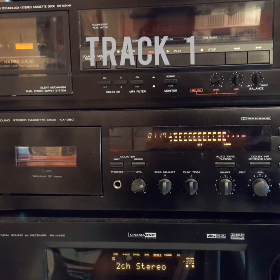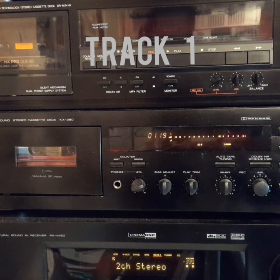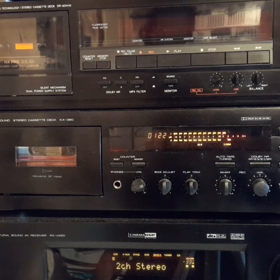Track 1, Channel Identification and Balance. For this test, we use a 1 kHz tone recorded at a fairly high level, 3 dB below standard Dolby level, in fact, and we recommend that you keep your amplifier volume control at a low setting during the sequence to avoid speaker damage. The tone will appear first in the left channel and then in the right channel.